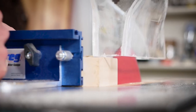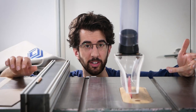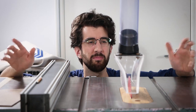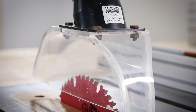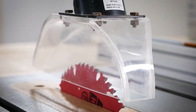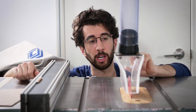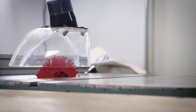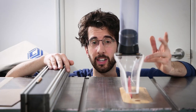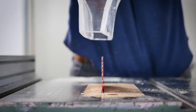I made three rips and four cross cuts and here's the amount of dust left over on the tabletop — I think it turned out pretty great. Was it a complete success? Maybe. I think the real issue is my dust collector is really not up to the task — with a bigger and better dust collector I think it would work perfectly. I immediately noticed it's more difficult to get correct pressure behind the workpiece when ripping, because of the width of the guard you end up pushing slightly offset of the blade, which can cause a different type of safety issue. Luckily it's very easy to lift up and swing out of the way.